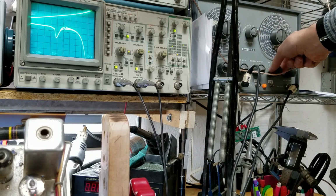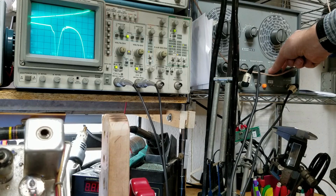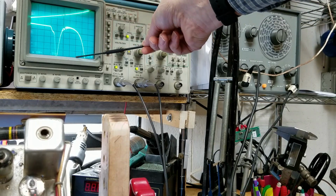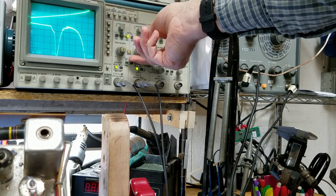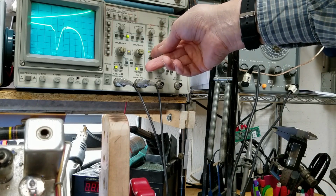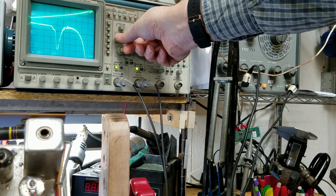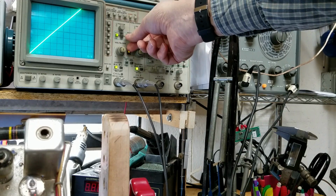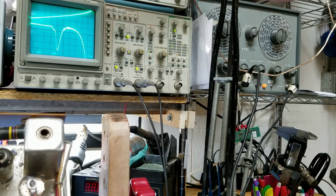And then the RF out, and this is at the beginning of it, I've got to make an adjustment with that as well. And we're starting to see the waveform that we want to create right here. But we see the marker is way off, which we should be because I've messed with it. Now the controls on the oscilloscope are such where we're in the XY position. It's important that you're in the XY position. We want to monitor channel 2. Here's why. If we monitor channel 1, the only thing we get is a diagonal line when you're in the XY position. And that can be confusing when you're trying to see all these lines floating around. So you can turn off channel 1. It's right now sweeping at 60 Hertz.